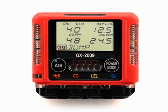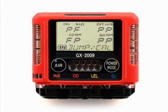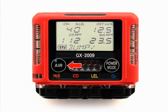Turn the regulator on-off knob clockwise to close it. When calibration after bump test failed is set to on and if any channel fails the bump test, the instrument will beep and a calibration is immediately and automatically started. Continue to apply calibration gas. At the end of the calibration, the instrument displays the results from both the bump test and the calibration. To view the bump test gas readings, press the air button. To view the calibration gas readings, press the air button again. To return to the bump screen in calibration mode, press the power mode button at any time. Turn the regulator on-off knob clockwise to close it.